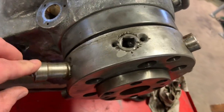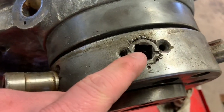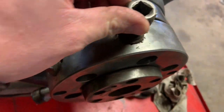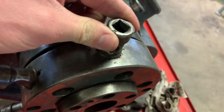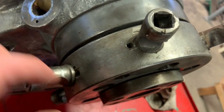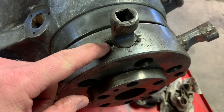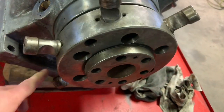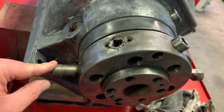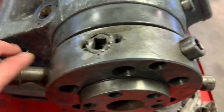So this is a D1-6 Camlock chuck, and for some reason someone drilled holes on each side of the camlocks. These were all down. I got them pulled up and I wanted to mark them to see which hole, but you can see. Some people speculate that someone had an issue with the chuck coming loose in a production environment. I do know that this machine was in a production environment in Indiana. You can see it looks like someone welded and ground there.